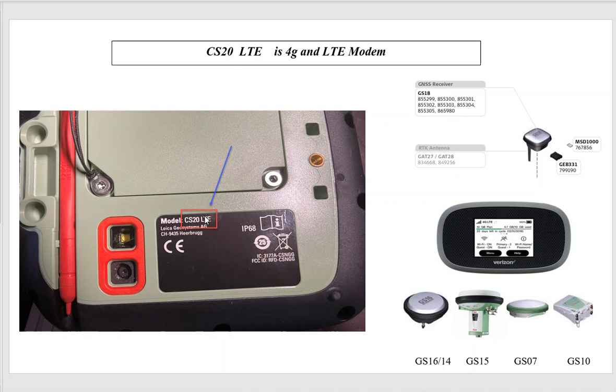Something really important: in the next part we're going to show swapping out a SIM card. The client had an older SIM card through AT&T that was from an older data collector — if you have an older SIM card from a 3G data collector, that SIM card is 3G. It's important to get a new SIM card. When we put a new SIM card in the CS20 LTE, it'll be on the 4G platform. We don't want an older 3G SIM card defeating the purpose of moving to a new data collector.